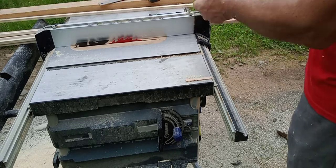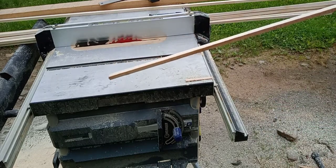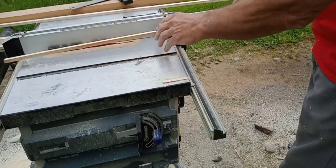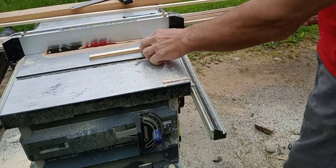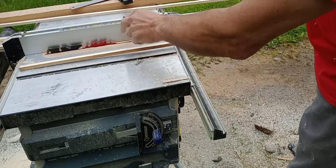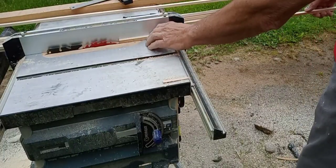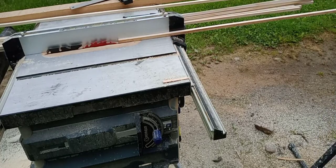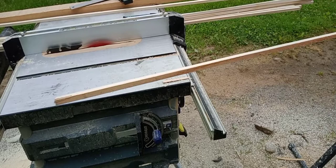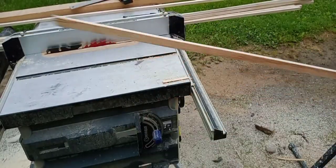These thin little pieces, when you're running these through the saw, there's a tendency for it to want to chip and chatter and kick. Whenever I'm starting this in, I'm holding it down and against the fence. But on the back side, I'm lifting and pulling back this way to kind of force it onto the table and against the fence — at least when I start it and get it about halfway through. I'll show you real quick what happens if you don't: you can see that it chips it and jerks it and wants to kick it back at you.